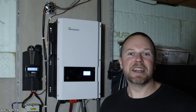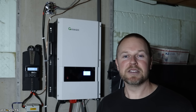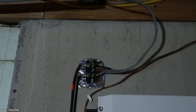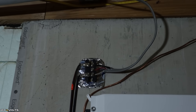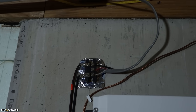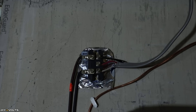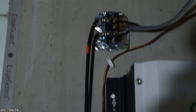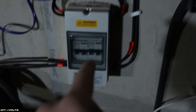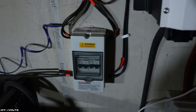It's a lot quieter in here. I've now stepped into the house where the electronics are stored. Let's take a look at each one of these components so you'll know what they do. The very first component is this rectifier. This takes those three wires — the three-phase AC power — and converts it down to DC. On the right there are three wires coming in, and on the left there are only two wires going out. Those wires take the DC power down to a breaker box that will allow the homeowner to disconnect the power if they need to.